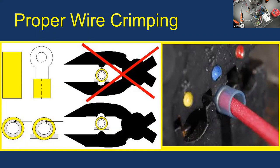In the chat window, tell me what the colors represent on the connectors. On screen you can see yellow, blue, and red. We're getting answers about thickness of wire and different gauges — correct. The colors are coded for the size of the connector, which corresponds to wire gauge. If you're using the gauge wire for the blue connector, don't try to put a yellow large-gauge wire in and crimp it. Always match your wire gauge to the connector color. They're color coded for a reason.